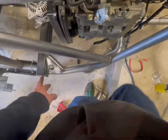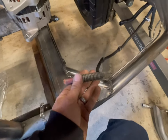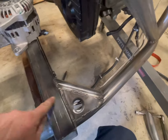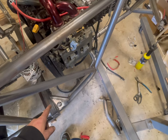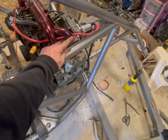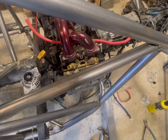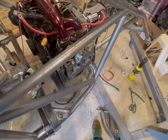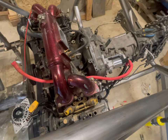I'm going to do the wrap over top of this just to cover it up so it's not super bright red running through the entire engine bay. I'm going to have a terminal block somewhere right here where it'll have a disconnect, that way I can pull that section of wire out and leave the stuff that goes up to the front. The grounding one will have a chassis ground off of that, and then another lead will run up to the battery - so that'll cover the engine ground, the chassis ground, and it'll all connect back to the battery. That way everything has a good thick solid ground and I don't want any wiring issues with this car.